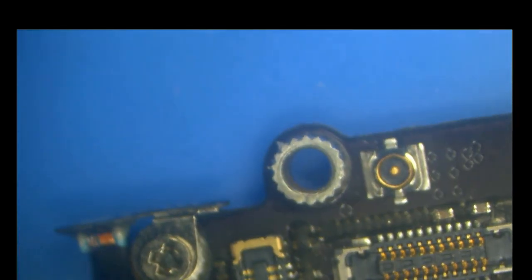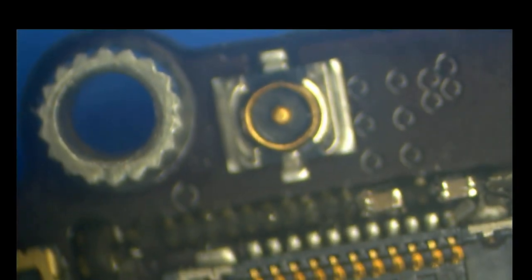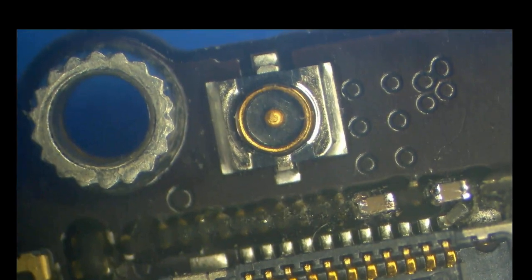But then, most importantly, we found that this cap here, this guy, look at him. How does he look? Somebody has hit him with some kind of a tool. So this guy has been damaged. You can see that he's sort of like filleted open. He's been knocked by a technician probing around here, or knocked by a technician taking off a home button connector with a tool at some point. So right now, that guy we know is on our shorted line, and he's the ugliest looking guy.